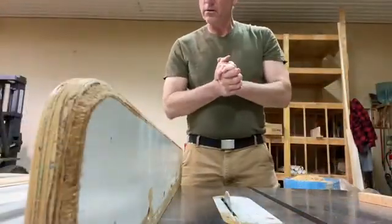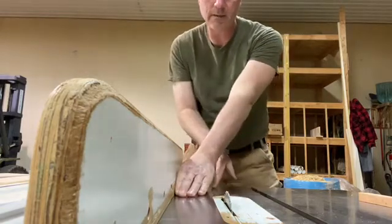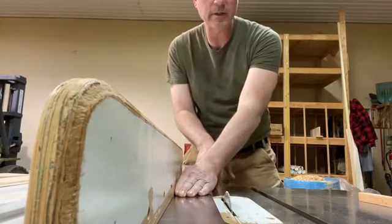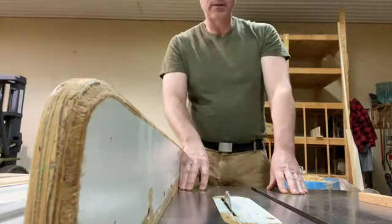A couple things that you shouldn't do while you're using a table saw. You should never crisscross your hands. That type of thing. Because if you ever get bumped or you trip and fall, you're going to fall into the blade. Always separate your hands. This is on all woodworking equipment. Never ever cut with your hands crossed up because you can end up in trouble.